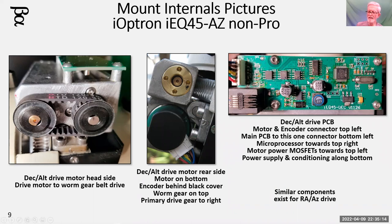This is the board, and actually the board you see here is upside down. It really wants to be with the parts facing down. And when I face it with parts down, it goes flaky after getting warmed up. When I face it with the parts up and the cover off, it seems to work just fine. So my guess is one of these three chips right here, when it starts to get warm from use, goes flaky and the motor stops. That's what I have to diagnose.